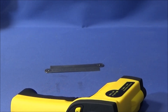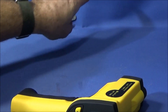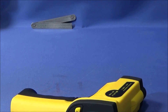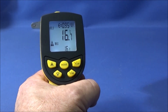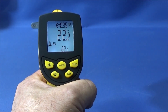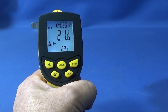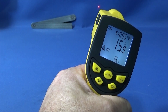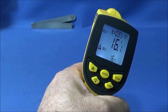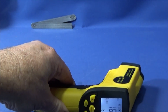As an example of the emissivity control, I have this stainless steel rule here which has been in this room, so it should be the same temperature as the cloth on the back of this bench. But it'll give a false reading because it's very reflective. Measuring the ruler gives a figure of around 21.6 degrees Celsius, but measuring the cloth gives 15.9 degrees Celsius. If I change the emissivity control to what it says on the chart, I'd get a much more accurate reading.